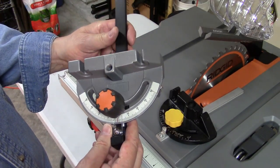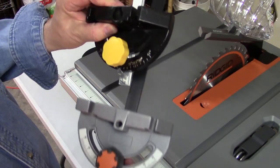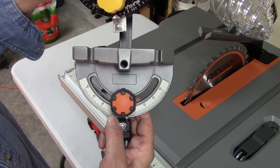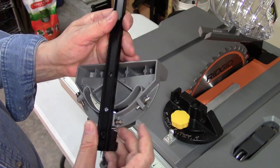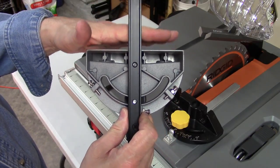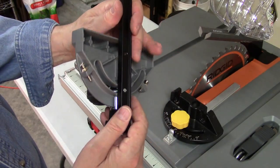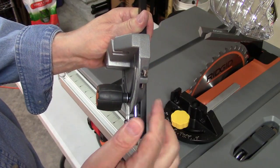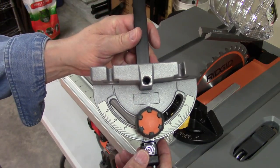Now, is this a $120 to $200 miter gauge? I don't think so, but I think you can get pretty accurate with this. If you compare the increments on here, look at the difference in how fine the increments are on this one compared to the cheaper one, which is typical of even the more expensive saws. Also, what they have on this is stops that you can set — take your measuring devices, measure to make sure this is square or 45 degrees, set these stops, and use the indicator to make sure you're at the right stop. This is especially useful if you're moving back and forth between different angle cuts.